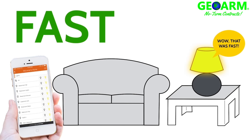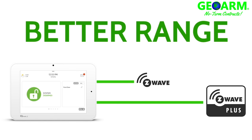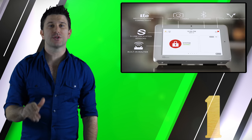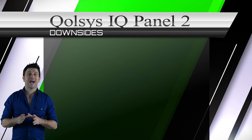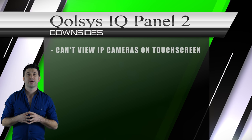The IQ Panel 2 is one of the first panels ever to offer Z-wave plus technology. Z-wave plus improves speed, security, and range compared to standard Z-wave devices. The IQ Panel 2 has all of its communicators, modules, and backup battery built directly in. All an end user needs to do to begin installing and programming the panel is to plug in the power supply and decide whether they want a wall or desk mount.